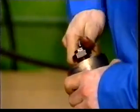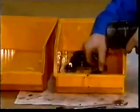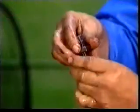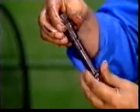Checking of the nozzle holder. Dismantle the adjusting screw from the nozzle holder. Remove the spring and push rod. Clean the nozzle holder together with the other parts carefully. Remove the O-ring from the adjusting screw. The O-ring must always be replaced.